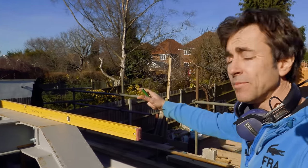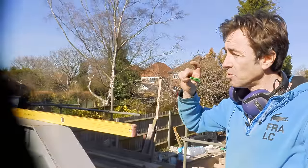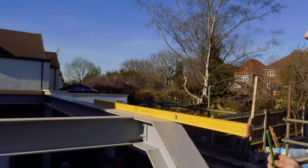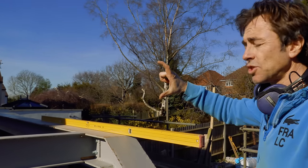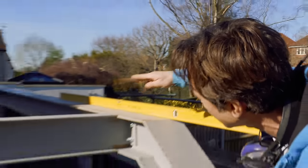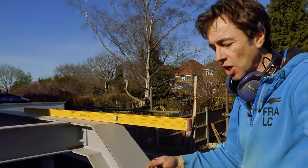Around the perimeter of the building I've got a lean-to type roof, and I've got to make a lot of assumptions and calculate for different elements. There's a warm roof going on here. The level of the steelwork represents the top of the structural timbers. Then we've got a furring piece, then ply, then 120mm of PIR, which has the membrane bonded directly to it. So I need to bring my rafter up to the right height so that when the PIR's in, we can put the trim around a nice hard edge like a ridge straight over the tiles.